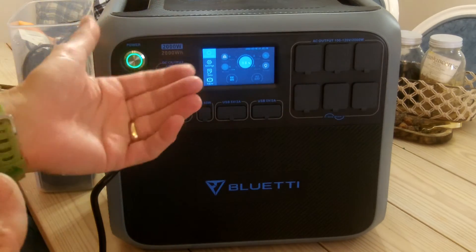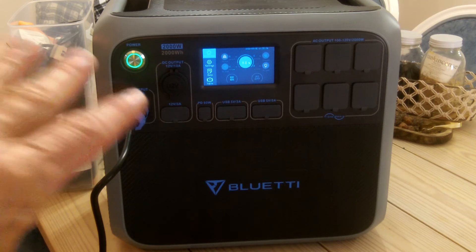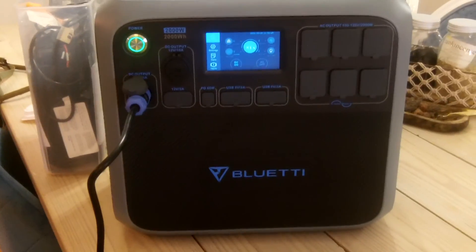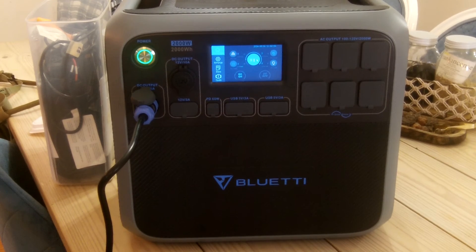The RV cord is already hooked to the system, so I'll just keep that rolled up and set aside. When I decide to go off battery I just plug in and I'm on grid. The next step is to drill a small hole in the RV so I can run some solar cable — MC4 connectors — into the RV and charge this Bluetti with some panels. I have 700 watts of panels sitting right there against the wall. I could charge the Bluetti while I'm running the RV. These are options I want available in the event I go dry camping or have to go off-grid. I still have the ability to function in the RV — not with AC comfort, but with some fans and the roof vent open it's definitely doable in most situations.